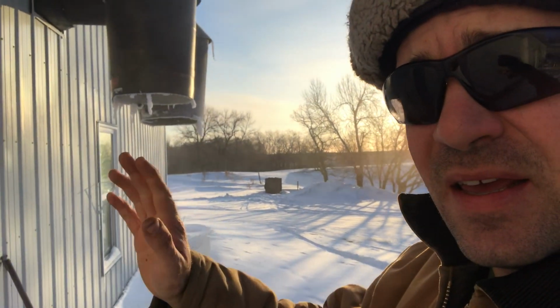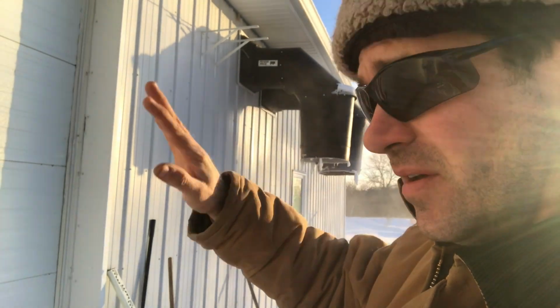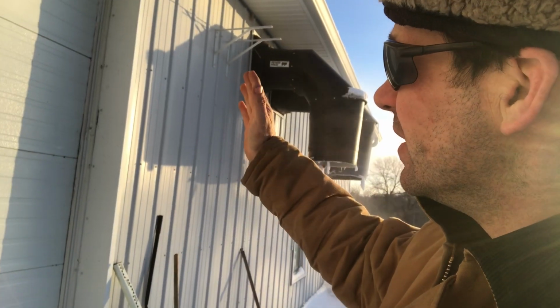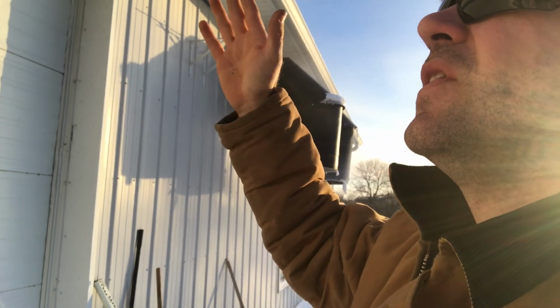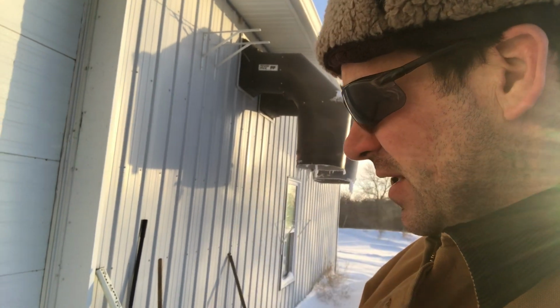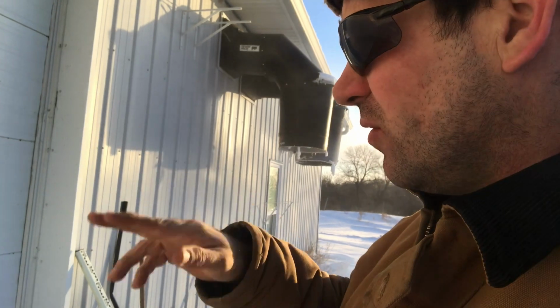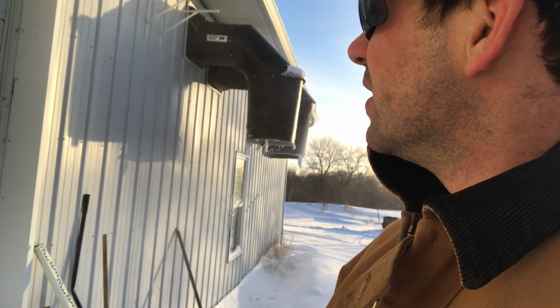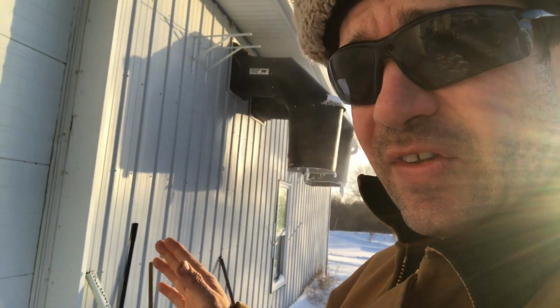But that shed is holding itself at 4 degrees without any supplemental heat. Basically, it's a 45 by 50, 12 foot ceiling, insulated all around. We have R50, I think, in the ceiling, R25 or whatever in the walls, and then 2-inch rigid board underneath the cement pad. So we're insulated all the way around. It's a very well insulated shed, and it has 1,500 honeybee units inside.